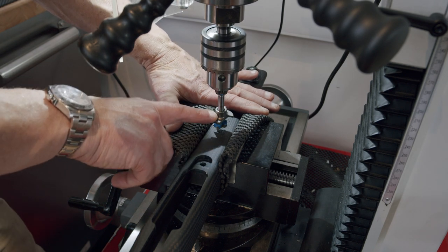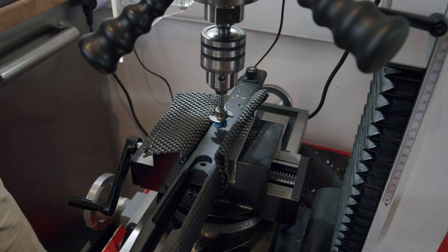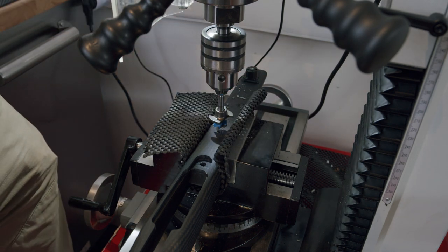Onto the next level. Now I've got my 19mm Forstner bit with the stop plate set just deep enough so the gunsmith adapter will protrude by about a sixteenth of an inch. Here we go.